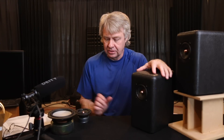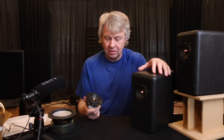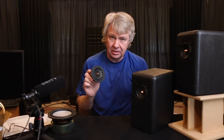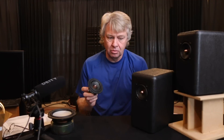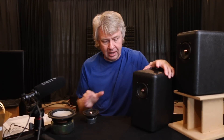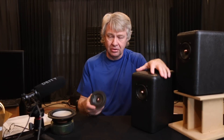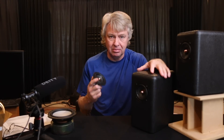It's still bugging us a little bit that you can't really throw some juice to them or play them wide open without getting them out of shape. So we've been working on a new version — this just came in: same woofer but with a much longer X-Max. We're going to try to see if we can get this to work in the same application. If the frequency response is still smooth, we'll use some of these drivers for applications where we've got a single unit, and that will let you increase the power on it maybe almost double — but still, it's a small driver. You're going to run out of X-Max if you start beating on it.